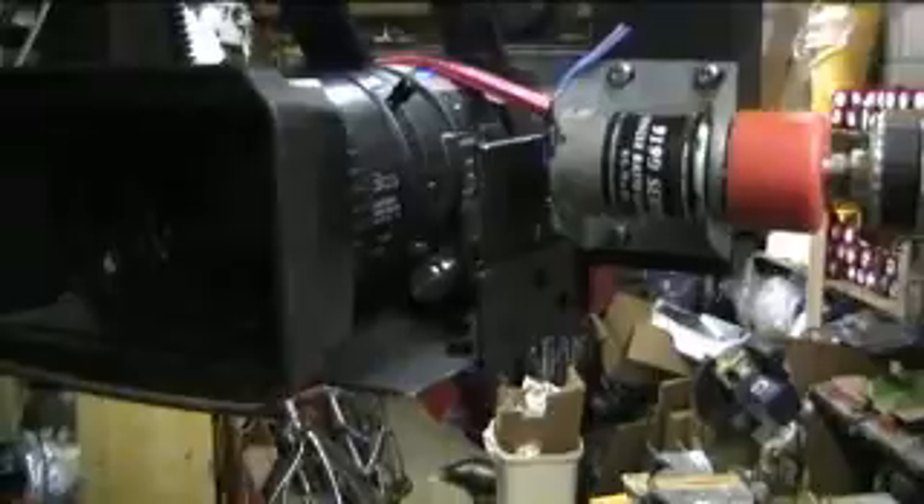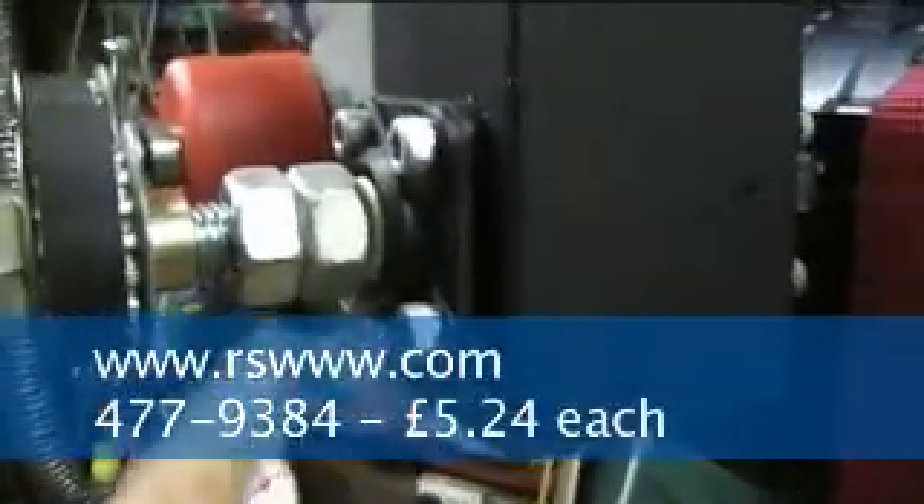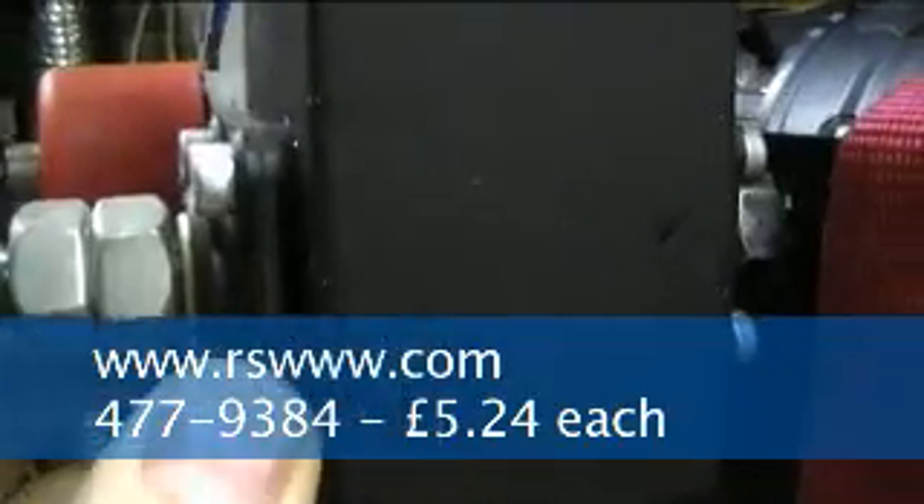But other than that it's just a case of the motor turning the camera platform around. The bearings are something you should definitely look into. These are plasticky ceramic inserts in a sort of glass nylon bearing frame, and the advantage of these is they're very light. That little white bit there doesn't actually rotate — it's just a bushing and it allows the shaft to slip around inside it. They're about five quid each and there's three on this particular thing, but they're well worth using over big pressed steel bearings because they barely weigh anything.